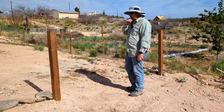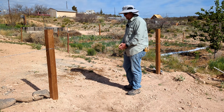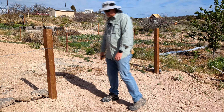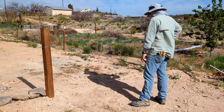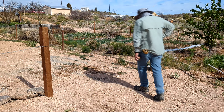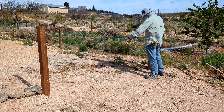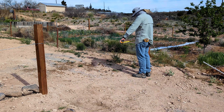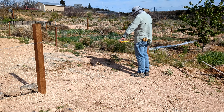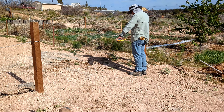We need gates, so we're gonna make a couple of gates. They're both gonna be three feet tall. Maybe I'll start with the small gate — I know I want it to be 37 inches. I'm not entirely sure exactly how far it's gonna be off the post, probably like a half an inch off the post. Hinges welded to it will only open in one direction. So this one I want to be 37 by 36.